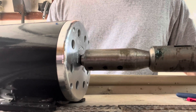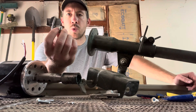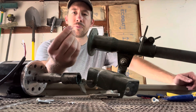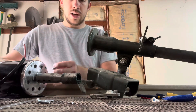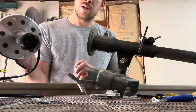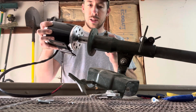I have the Swamp Runner coupler hooked up to this 36 volt motor and I can go ahead and hook it up to the shaft. I think these were 6 by 20 millimeter bolts and the thread pitch was about one on them, so that should let me connect straight up through here into those threaded holes.